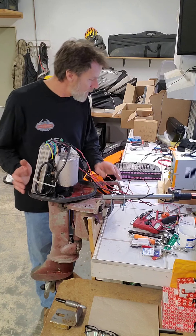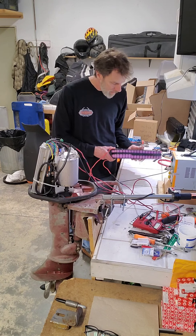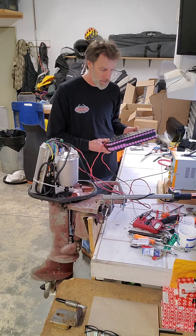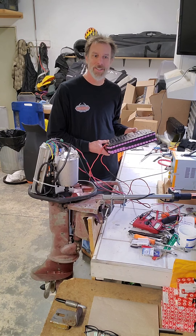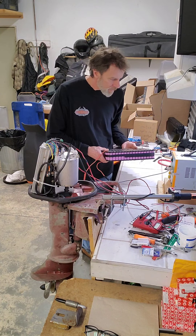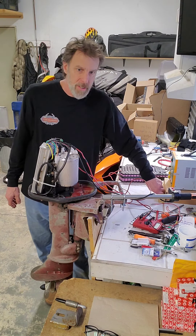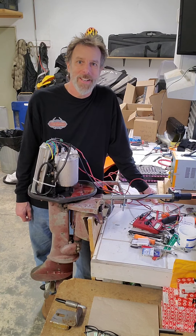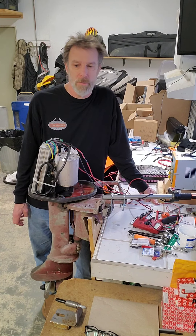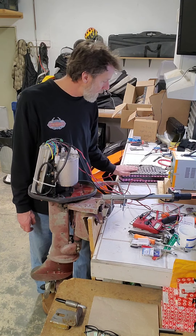What I did is salvage some old 18650s from a couple of failed e-bike batteries that got partially swamped. I've spot-welded them together into sort of a franken-pack here — it's a 10-parallel and 13-series configuration. These are Samsung ICR 18650s.